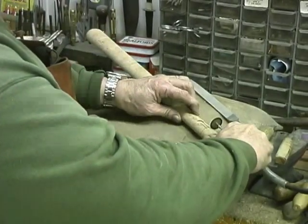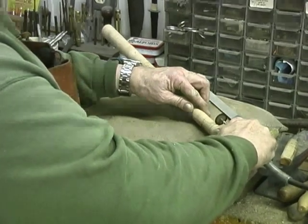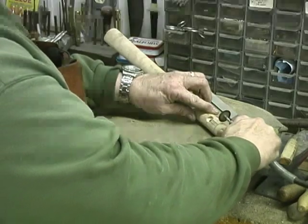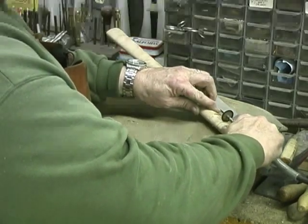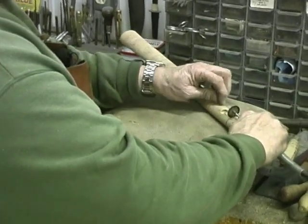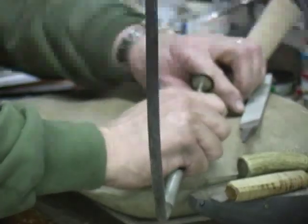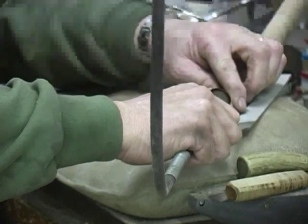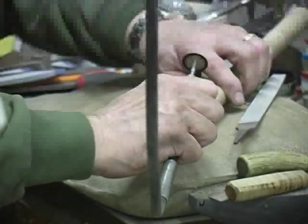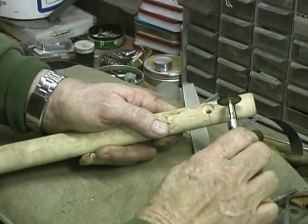I'm resting my hand and holding the angle straight and rotating the wood. You don't want to cut it in two, but just come right on around it like this. Now we got a good depth of a little over a quarter of an inch. Now we're going to move in and we're going to cut our channel, try and center it.